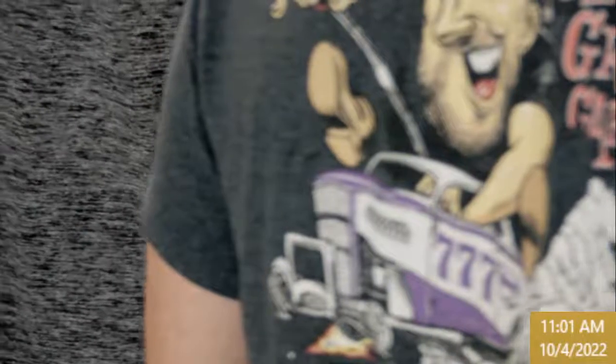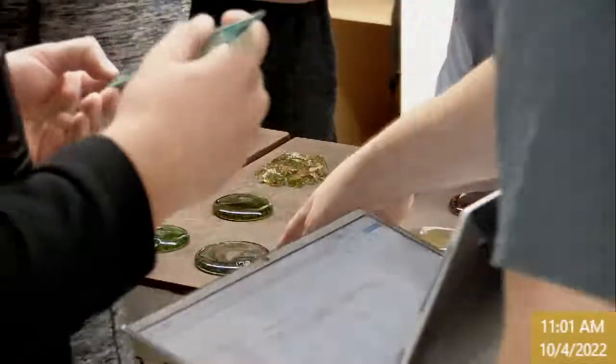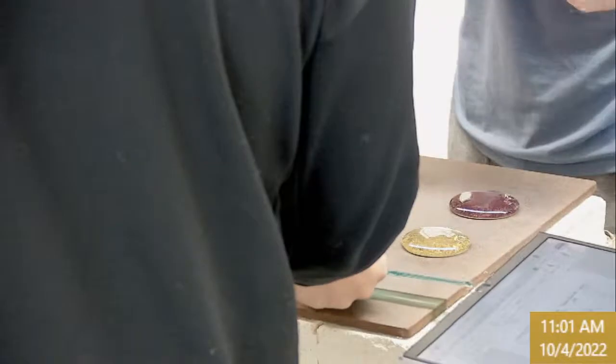So here's the moment we lost the blue one on screen here. Right there, you can see what internal stress looks like. What's kind of spooky about it is, where is the force coming from? How does it do that? Well, the answer is it's in the bonds. They're like a billion little springs. If they're all slightly loaded, all that can relieve, and that energy comes from stored spring energy in the bonds during internal stress. So it's really surprising.